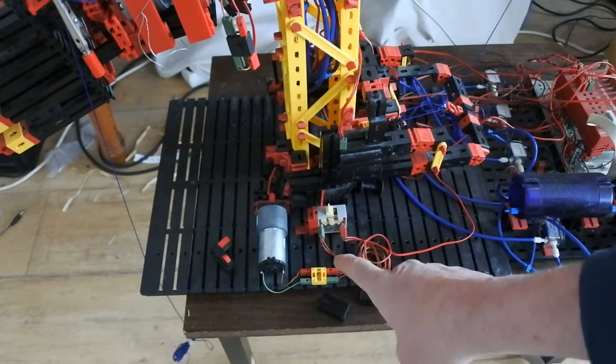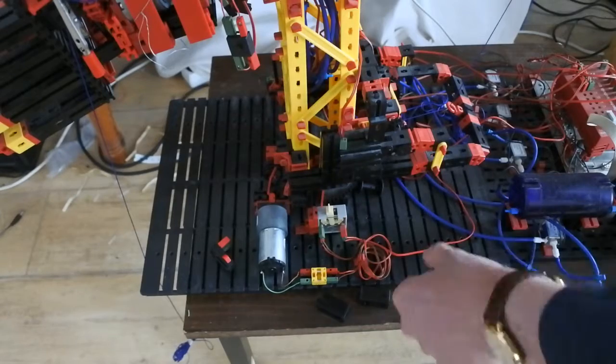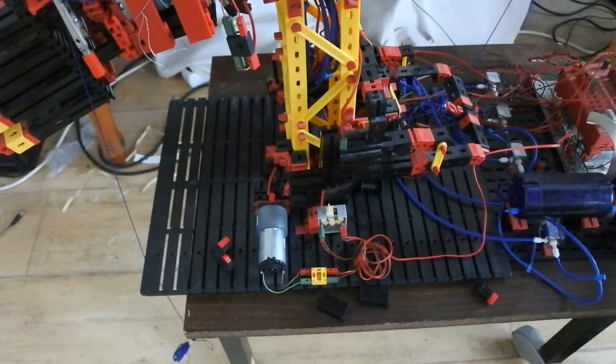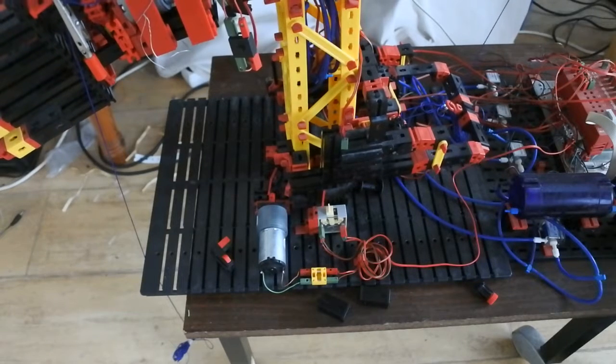So first I have to use extension motor 2 to move this way. So on the computer I open the interface, and if that will work out, yes, now it does. Select interface. And it doesn't do a thing, which is worrying. We check that is this wire, which goes here, and it is extension motor 2, which is in the diagnostics the slave motor 2. Okay, that works. Now it works.